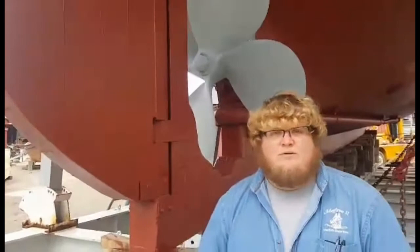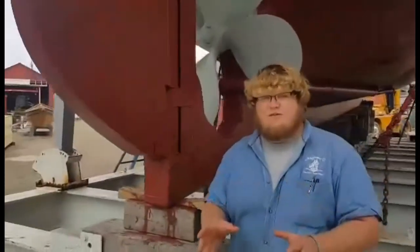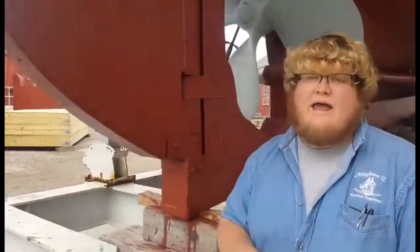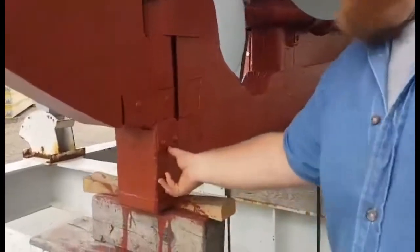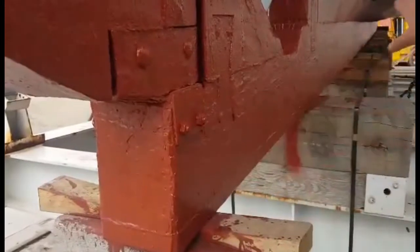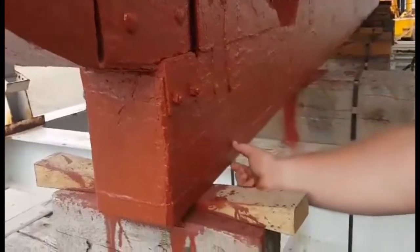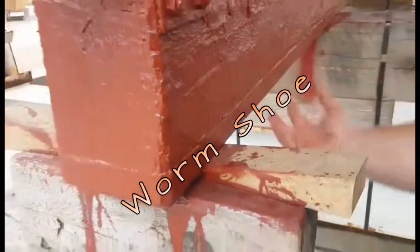The Sabino has the exact same thing as a wooden boat — essentially a protective piece of wood all the way at the bottom of the ship that is essentially a sacrificial piece of wood. You know that it's going to get eaten and worn away, but that's okay because it's protecting the really important parts. If you zoom in, you have the keel — the very thick structural member that runs the entire length of the ship, the backbone of the boat — and this smaller inch-and-a-half piece that also runs with it is what we call the worm shoe.